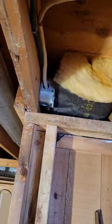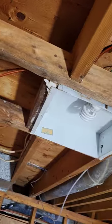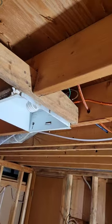And then they have a buried junction box. This was all in behind the drywall — not good. So that one, this one over here, has got to be fixed too. That's not good.